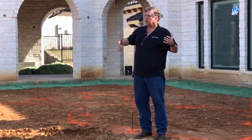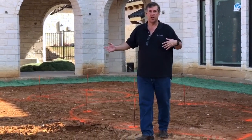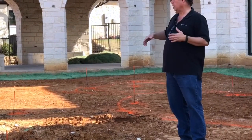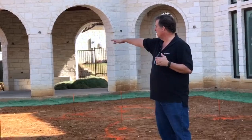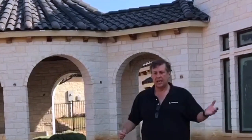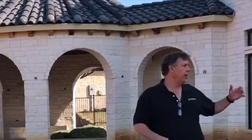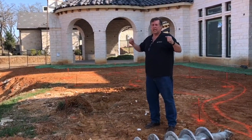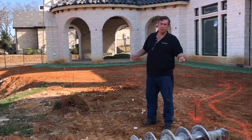The hard thing to know is sometimes whether there's fill dirt or not, after you finish the dig of the pool. But in this case, we know definitely we have a mountain of fill dirt here. You can look — the trees are all lower down there, the house is up higher, so we have to do piers on this. A lot of times people say we didn't pier the house, but as you go up the hillside, maybe the house is on original grade and doesn't have a problem. But when we pushed into the backyard, they lifted it up, so we're in fill dirt. The house might not be piered and we may still have to pier the pool. So that's one of the two reasons to pier a pool.